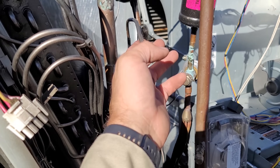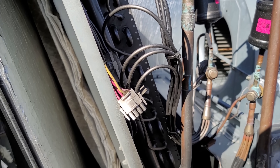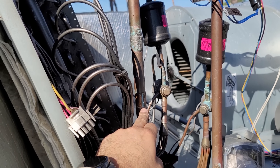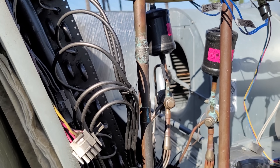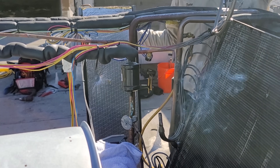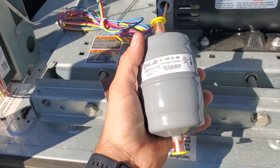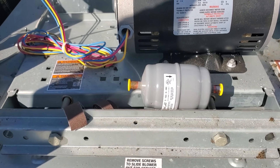I just want a suction dryer because of the potential moisture contamination. With a little more access in here, you can clearly see the equalizer line. I'm trying to think how I want to re-pipe this. I wonder if I can cut it right here, fit the suction dryer right here, and still have the equalizer line down here. We're going with the Sporlan high acid catch-all dryer — it has the HH core inside. I went with a bigger capacity dryer. We are going to have to adjust the refrigerant charge a little bit, but I'm worried about moisture, so that's why we're going with the high acid core.